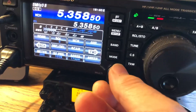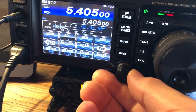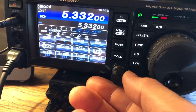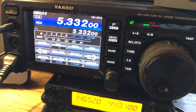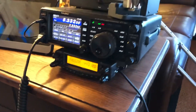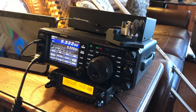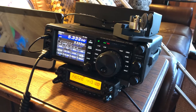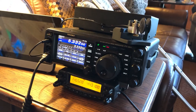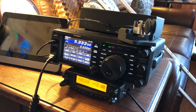Now look at the meter SWR — it'll be a little higher on one end than the other, but two to one on the bottom end, barely moving the meter. That's what I found as far as getting it to tune on 60 meters. It worked out great — I've had three QSOs today on 60 meters and I was 59 on everybody. Catch you later, bye.